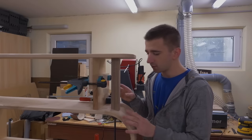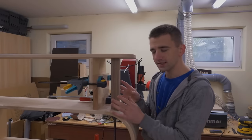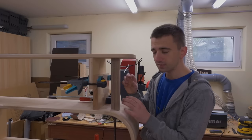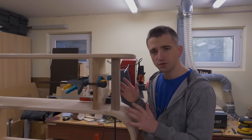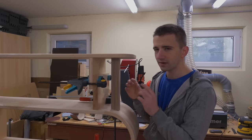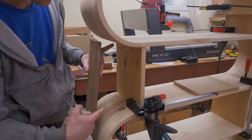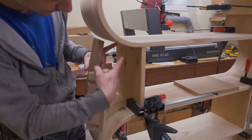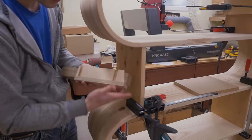And that's also the reason why I sanded everything before fitting the supports, because otherwise the very slight thickness change from sanding may have ruined a great fit. Except for the last 240 grit pass I'll make, there I think the thickness change is insignificant. For all other supports it's now basically the same, except for the ones that connect two round parts, there I sneak up on the fit with the router template instead of the table saw.